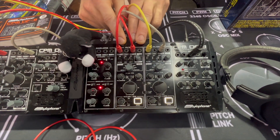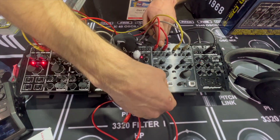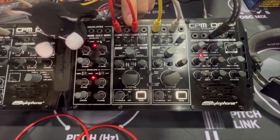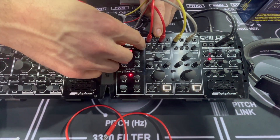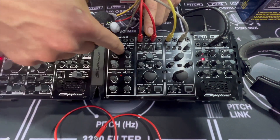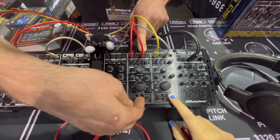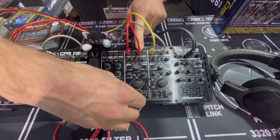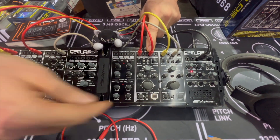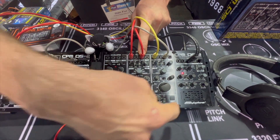But there's more — it's not just a filter, it's a VCA. What's really exciting about this VCA is with these little triggers down here, once we turn off the looping envelope, we can see they act as a trigger for these envelopes. We can also turn this on and there's a threshold knob — as soon as we bring the signal past that threshold, it becomes a trigger, an envelope follower that then triggers either envelope one or two respectively.